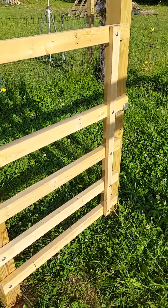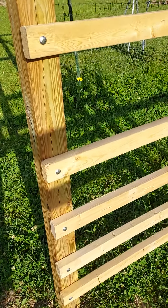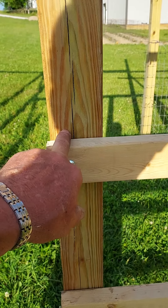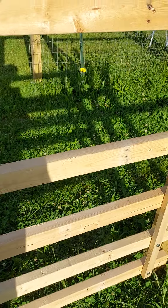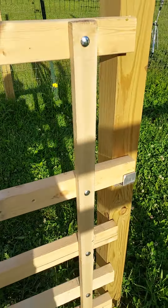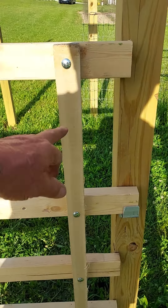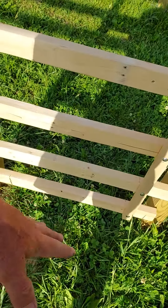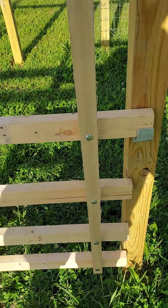This is my folding gate. First thing I made sure I did was keep these bolts over as far as I could on this 4x4 — gives me more, it'll pull it back further. Then I took this one-by-two and measured what I wanted. Mine had to be closer at the bottom because the animals can't get through — that keeps it from folding up quite as far.